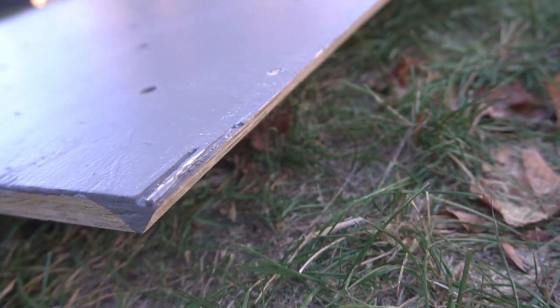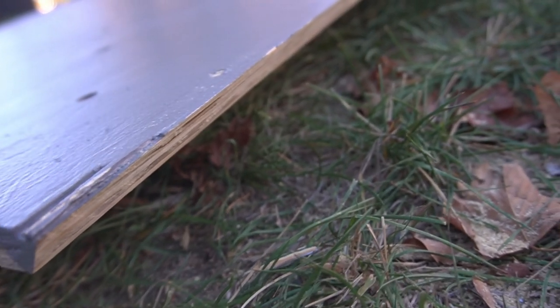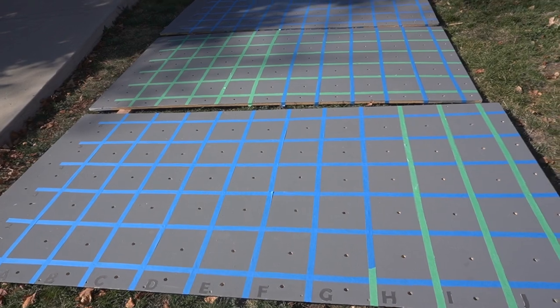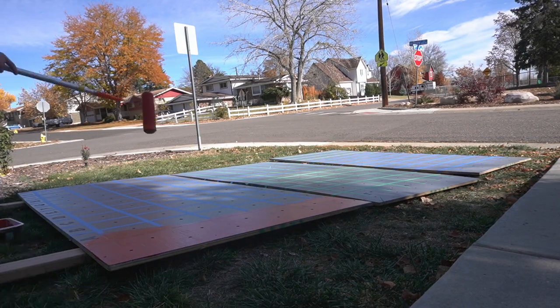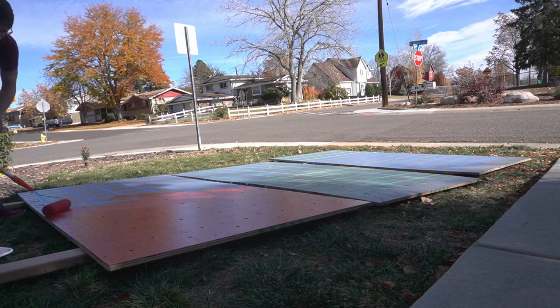This sheet of plywood I chose to be the bottom sheet - I cut the bottom edge at a 40-degree angle so that when I put it up on the wall it will flush mount with the kickboard. Here are all the boards that are taped, and what video wouldn't be complete without a time lapse of painting these three panels.